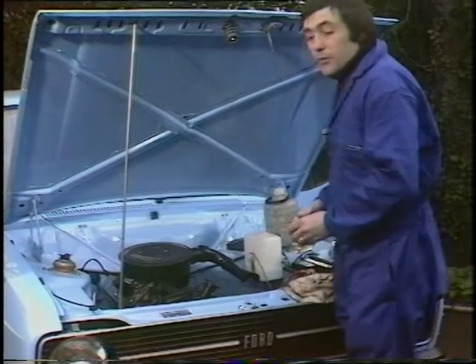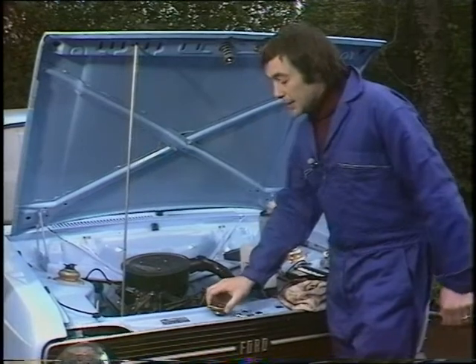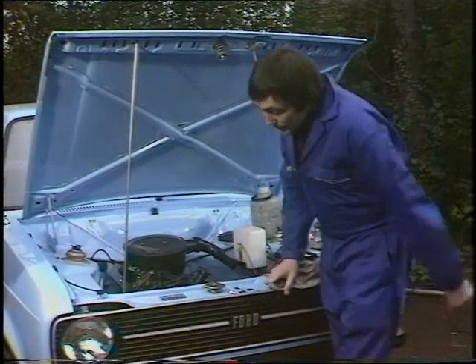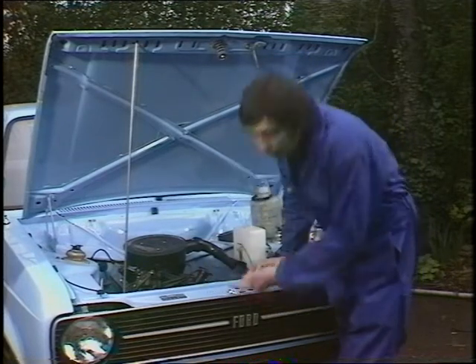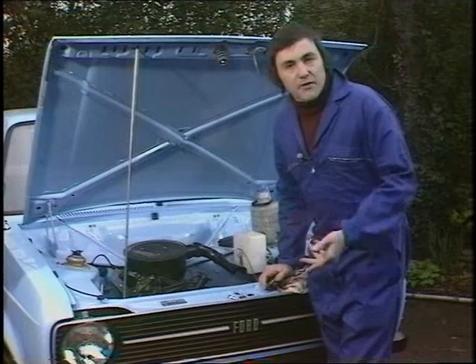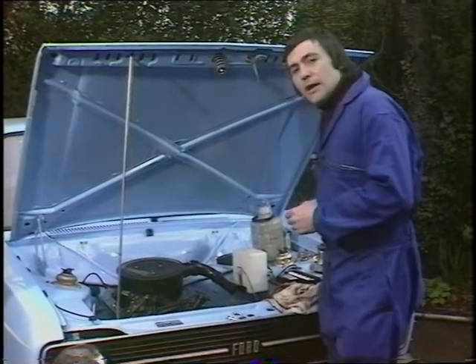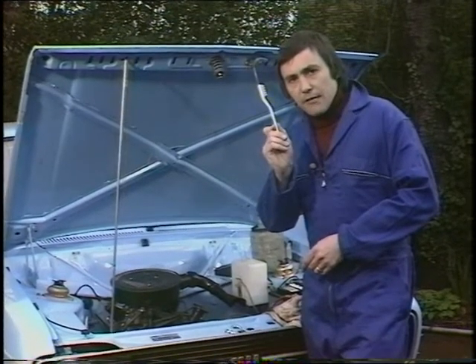Another possible reason for overheating is that cooling air is not actually able to get through the radiator. To check this, take the front grill off — usually a few self-tapping screws — and have a look at the front. What you're looking for is whether the radiator is clogged up with moths, bugs, leaves, mud and that sort of thing. If it is, clean it down. Don't attack it ferociously with a wire brush — use a nice old toothbrush and do it very, very carefully.